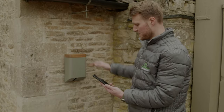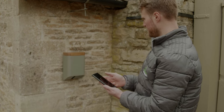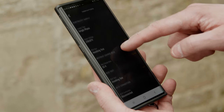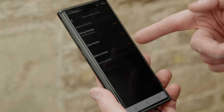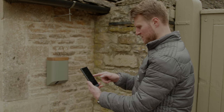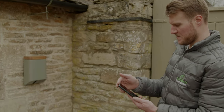The installer app connects to the charge point via Bluetooth. The initial pairing procedure is done with the energy manager right next to the device — you can then go and install it, and provided the signal is within range it will connect automatically and immediately give you data on how much the property is drawing. In the installer menu, scroll down to Smart Home Setup — you can see the energy manager is already paired and connected to the charge point. Clicking into it shows two bars out of four signal strength, which I have no concerns about dropping out, as there are some thick walls but not much obstruction between the charge point and the mains.